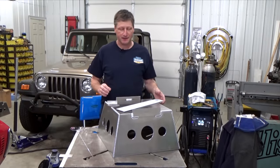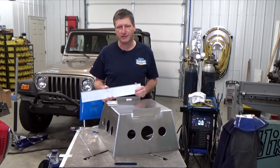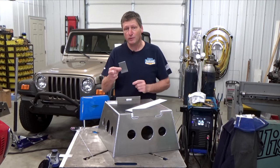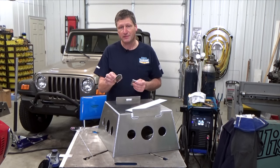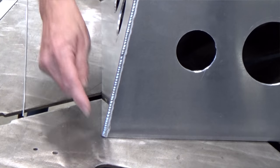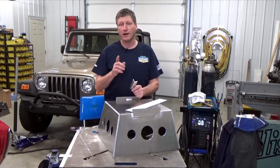Last but not least, you'll have a few drop-off pieces left from your 4x8 sheet — these are about 3 inches wide. Cut 16 two-inch pieces off them and then bend them at a 90-degree angle. These are going to be your bottom corner doublers. After you weld them on, check your corner welds and make sure they're flush with the sides; grind or file them if needed.